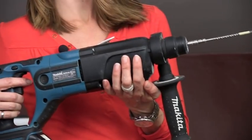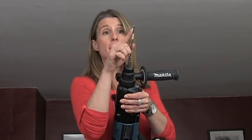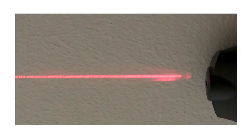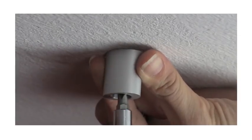The other thing you have to think about is what type of drill to use. If you're drilling into drywall you can use a standard drill, but if you're drilling into concrete like I am, you're going to need to use a hammer drill. You can always rent one if you don't have one. Before I start drilling, I like to mark with masking tape on my drill bit how far I need to drill — that way I know when I'm done. Start drilling the holes for the two end supports first. Before you drill the hole for your middle support it's a good idea to double check that the mark is perfectly in line with the two end holes. I use a laser to check this — there are even some lasers that will stay on the ceiling on their own if you're working by yourself. After all your holes are drilled, you finish putting in the supports.